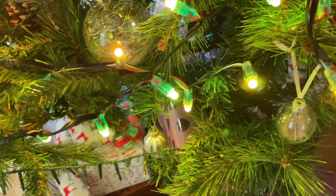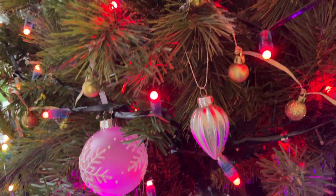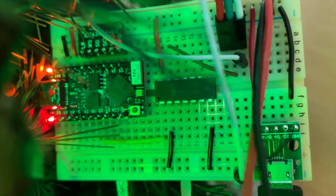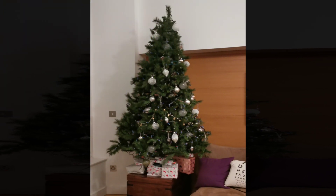So what's happening? I've got a string of 200 addressable WS2811 LEDs running up the tree. I've just put them on as you would a normal set of Christmas lights, and I'm using my self-organising LEDs project along with an ESP32 to drive them. To make it work we just need to calibrate the position of each LED on the string.